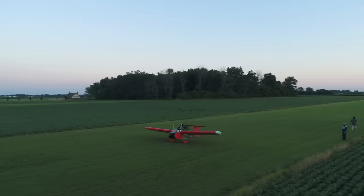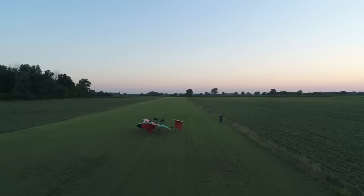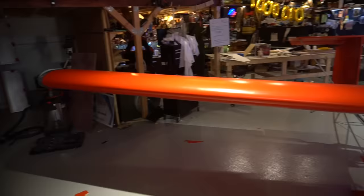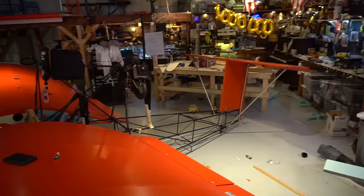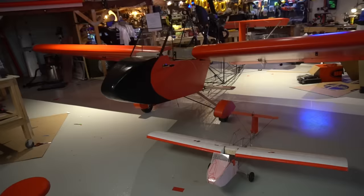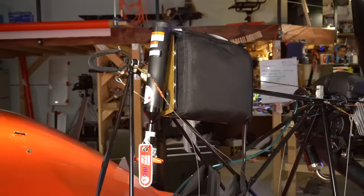I'm enjoying it a lot. I think there is still some stuff I can probably come back and tweak, because overall, the plane actually ended up being a little bit over budget on weight. It ended up being about 50 to 70 pounds higher than my projected weight, which is an empty weight of 150 pounds without fuel in it and without the BRS. It ended up being about 240 pounds right now as is. The parachute weighs like 25 pounds, so that's on top of that. So it could stand to be a little bit lighter.